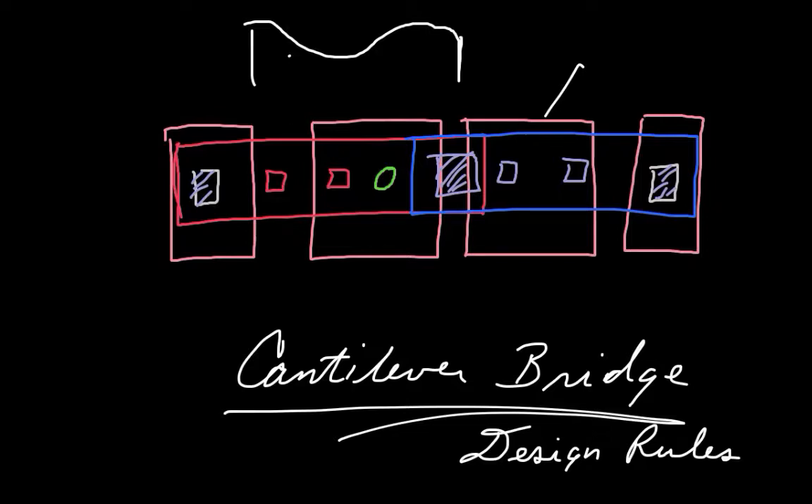That's pretty easy to remember. And this green circle here is supposed to be a dimple. Now there is a way of making dimples on the poly underneath the poly two structure, but they don't have a mask for it. So you have to do some kind of weird thing in anchor one to make dimples. We're not going to require that this time — I just want you to use the dimple layer and make some dimples according to the design rules. You want to put the dimple over a poly zero structure — that's one of the rules.